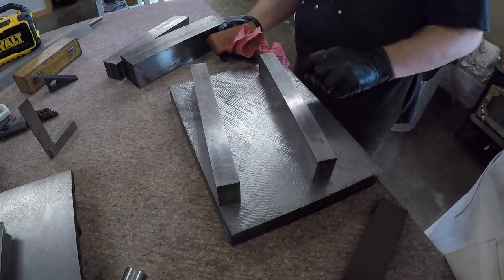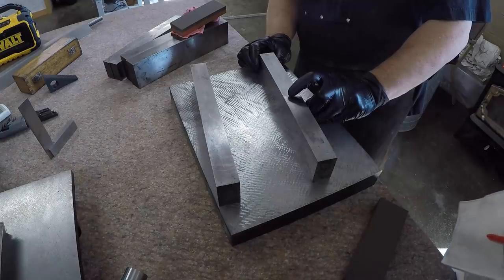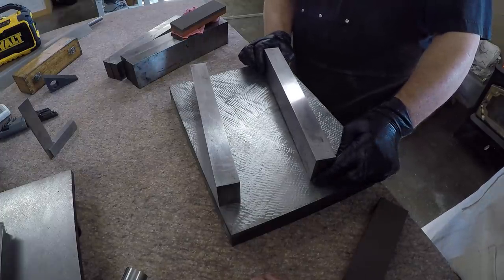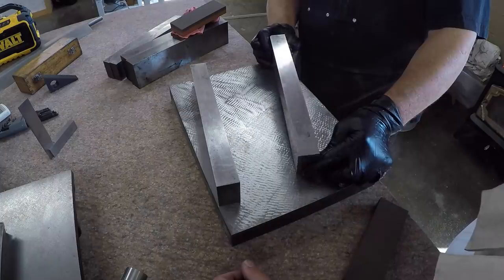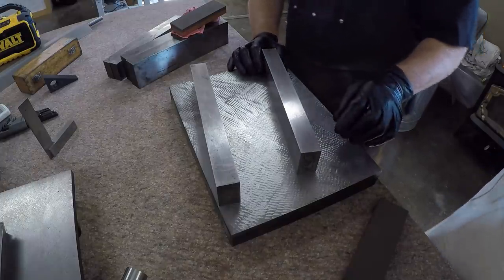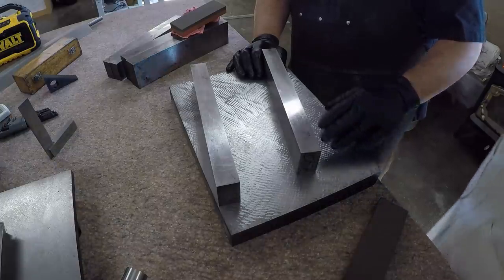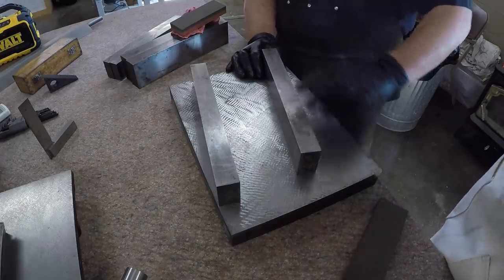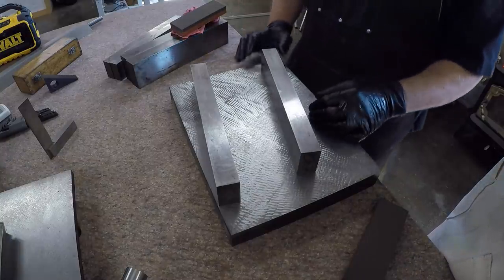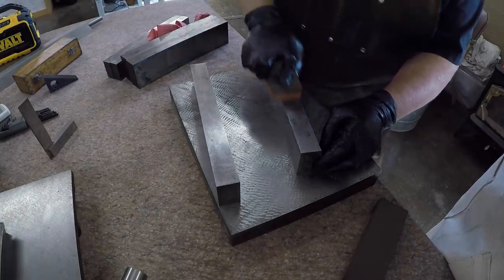But if you actually look, and I don't know if the camera can pick this up, there is an actual substantial high spot there. It was about 3 millimeters in diameter at the end of my finger. And you can see some variations in the grinding, because the precision ground stone is polishing this. So it's differentiating in that 50 millionths range of differences in height. I mean, these are exceptional. We're talking about extremely good to perfect. So polishing these first with the stone is the way to go, and then we'll go back and measure them. Okay. All right. Cool.